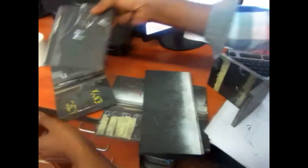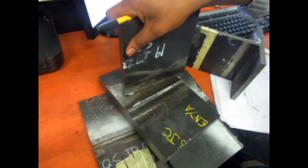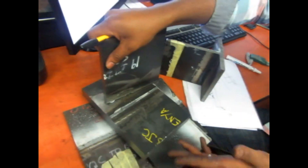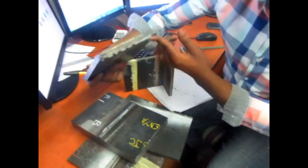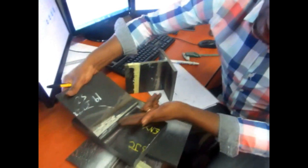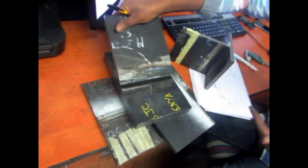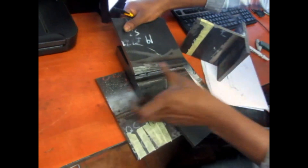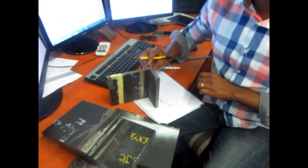For the fracture test, what you consider is the length — the entire length where the weld was done. There is a normalized length when it comes to how you cut your fracture sample; I think it's 150 millimeters for ISO. So evaluating along the length gives you an insight of how good the weld is along its length, but does not give you a full insight about the structure or the individual runs — because it's the length, while the macro test considers the face or the point.